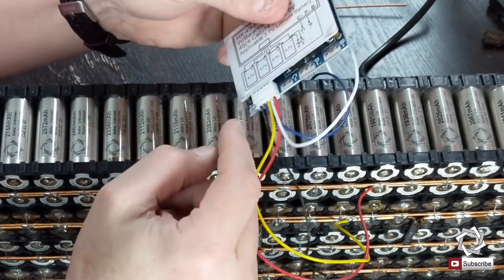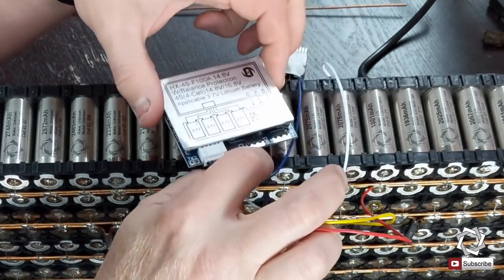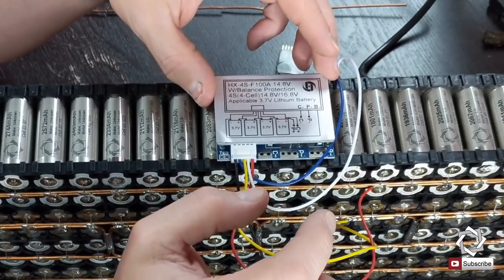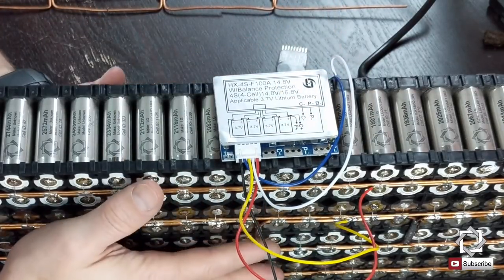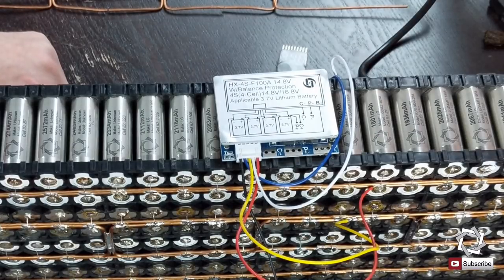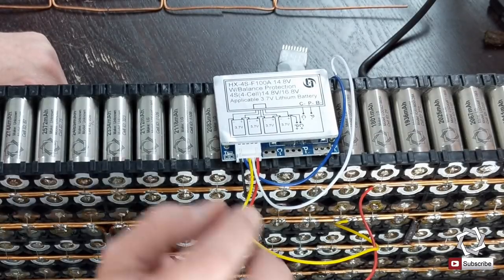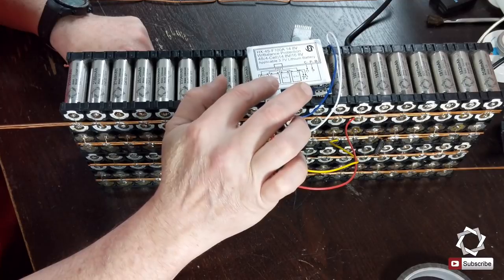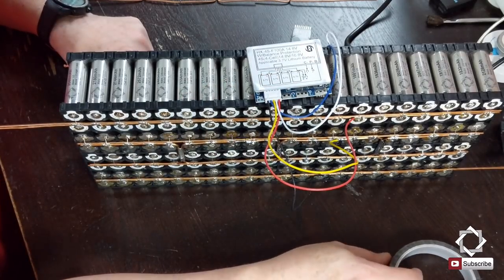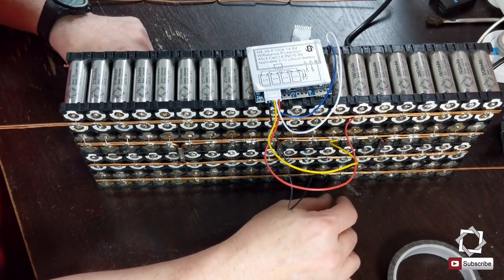I still need to hook up my battery poles to this, and I'll do that probably in the next video to show you how I did it. But this will just mount to the top of this, which will control the voltage and the amperage throughout the cells so that I don't overcharge them or undercharge them. It just allows a little more control, and it also gives me a balancing function, so I don't have to worry about going back and doing bottom balancing or working through whether they are balanced.